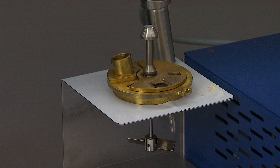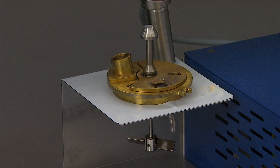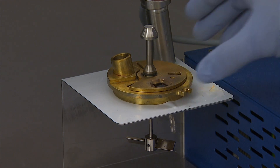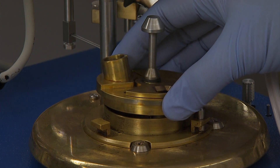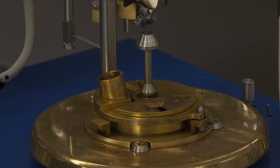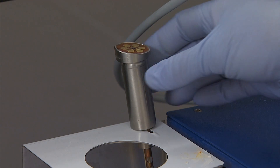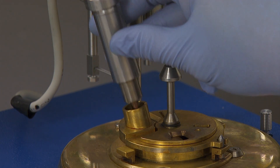The flash cup top assembly, which is the lid structure that will open and close while testing, includes a temperature probe and flash detector as a single piece, as well as a stirrer. The stirrer cannot be removed and will remain in place. Carefully place the assembled top of the test chamber on top of the sample cup. The lid portion includes a notch which will fit securely on the silver pin on the test cup — it cannot be assembled any other way. The probe or detector piece fits into the larger opening with the silver pin aligned with the notch.